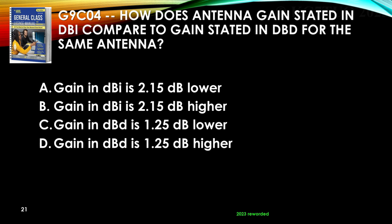So I have a question. On my ICOM, when I'm tuning, I should be turning down my RF power, because of what you just said. Your power setting, turn it down to 10 watts. So when I get my tuner, turn down the RF and then push tune. And that'll prevent arcing in the tuner as well. Okay. So you just turn the power down. Alpha, Bravo, Charlie, Delta.